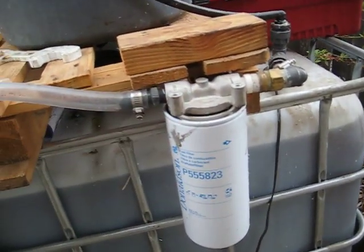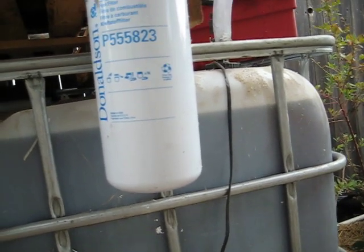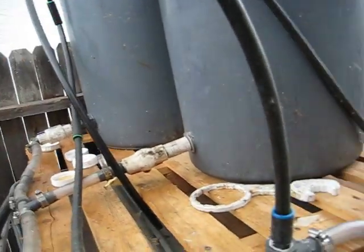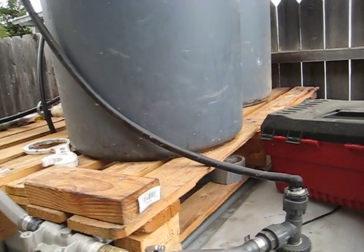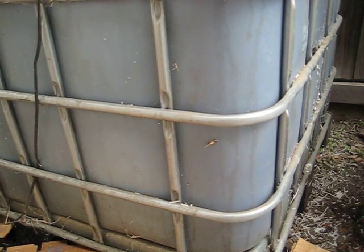Then it's plumbed through a Donaldson diesel truck filter — these are common for filtering vegetable oil. This one is a pretty large one and fairly inexpensive, about $14. It blocks water and filters to 10 micron absolute. I had to put in air release because the oil will get caught up by air bubbles, so on each step I have an air release pipe. After the oil goes through the Donaldson filter, it's filtered down to 10 micron absolute and all the free water has been blocked. Then it goes into a stand pipe that goes down to the very bottom of the tank, where all the particles under 10 micron and all the suspended water stay while the good oil floats to the top.